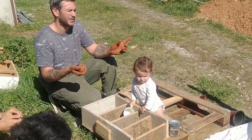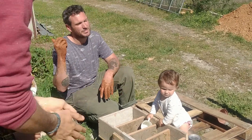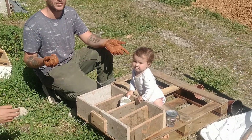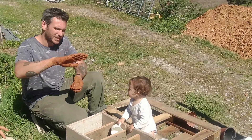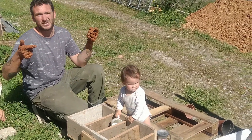There is a mark you're looking for, which is around 25% clay, 75% sand. But it's also going to depend on how it works on your wall. Because we're working on concrete, sand, and other surfaces — it's going to be different for each wall. So we're going to do tests of every mix on every wall, and maybe we'll use different mixes on each wall.